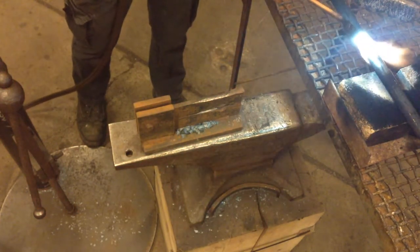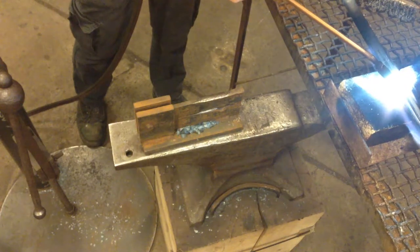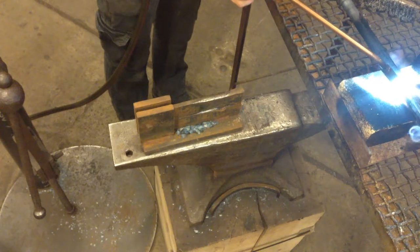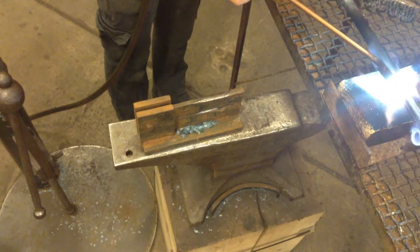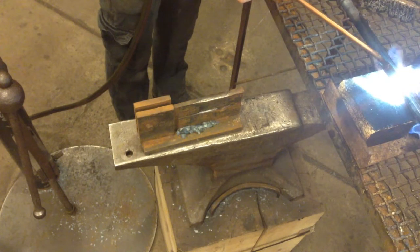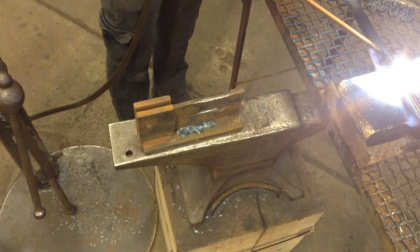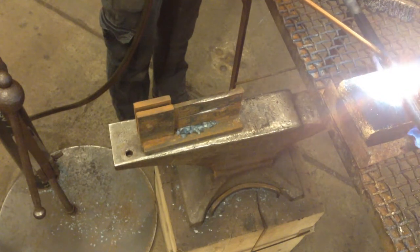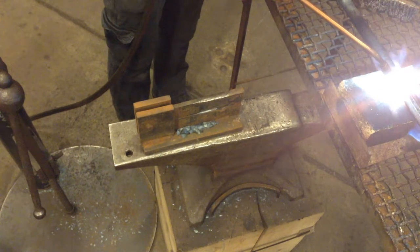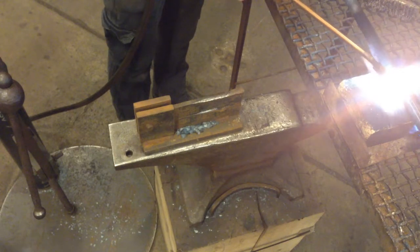We're going to heat up one of these regions for our knuckle. It's going to take a little bit of time to get up to heat, but you want to keep rotating your bar stock the whole time. That way you get a nice uniform ring. As you're forging, what you'll end up with is a uniform indentation around the perimeter, and that uniform indentation is what's going to allow us to upset that heated region later.